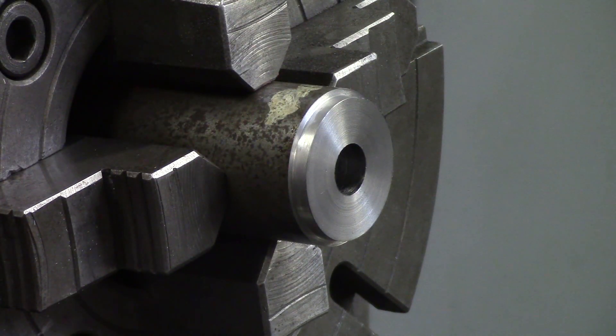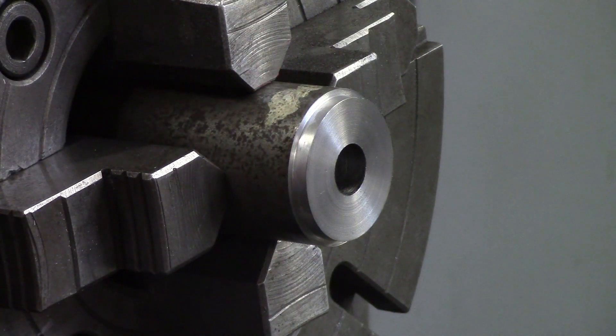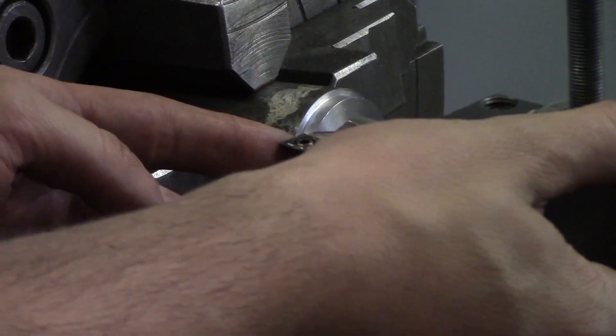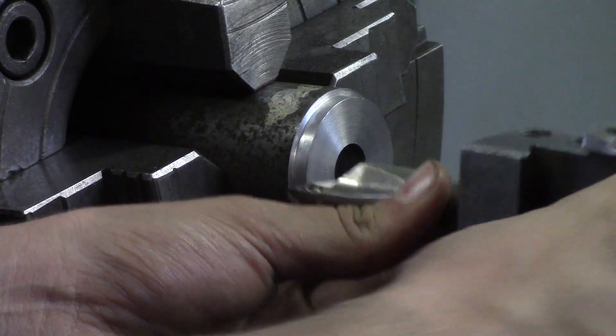Another consideration: some think you need to rough 10–20 thou cuts because boring bars are weaker, but it depends on the material, the insert, and how far the bar is sticking out. Make sure you're only sticking out just enough to match the depth of the hole — don't hang your boring bar out five inches for a one-inch hole, as that causes more push-off and chatter. The main rules: stub up as much as you can, ensure the bar fits inside the hole with clearances all around.